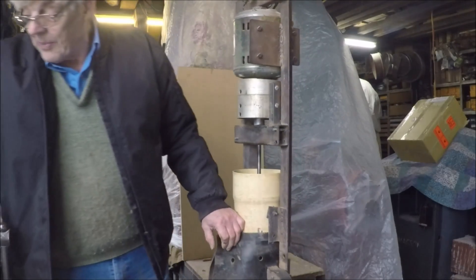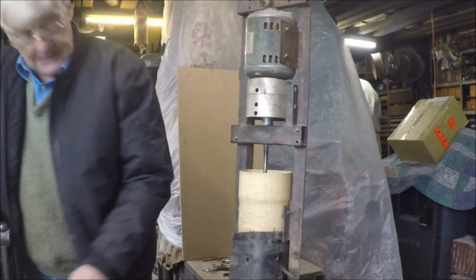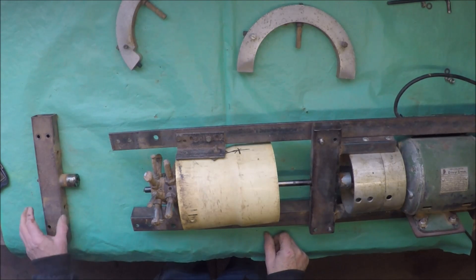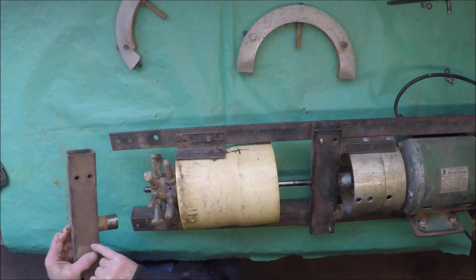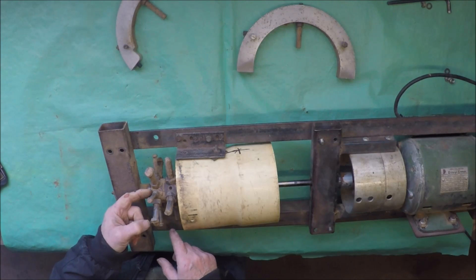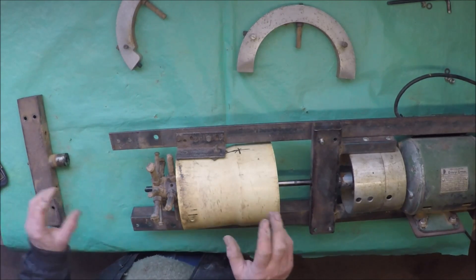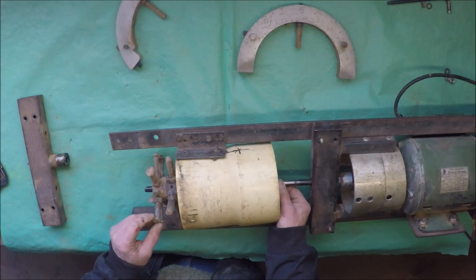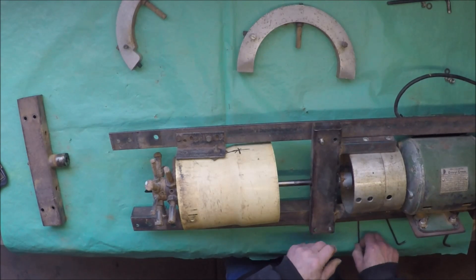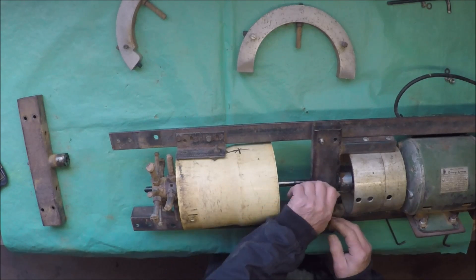If I take the bottom off, the rubber will just drop down. Now we have this heavy beast of a thing on the bench and you can get a bit more of an idea of how it fits together. There's the bottom bearing — it's just a bronze bush, with a grease nipple to purge the grease out. The bush fits right up inside here so that this thick-walled tube essentially protects this bit from attack by the sand. I'll take it all apart, clean it all up, reassemble it, and re-grease it while I'm at it.